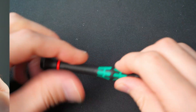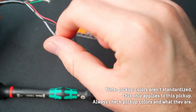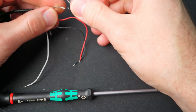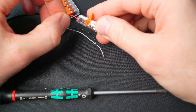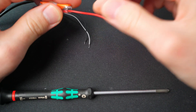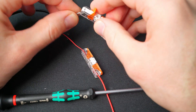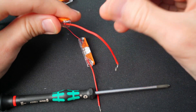You can take it a step further if you switch pickups often. Instead of soldering and re-soldering every time to the pickup selector, you can use these Wago single connector ones. Pretend this is the pickup selector. Here's the common ground lever nut, and here's a pickup with its wires: hot, coil splitting, black and white, and the ground and bare. Put the ground and bare into the common ground lever nut. Then take a single connector for the hot — put a wire on the other side, close it down, and wire that to where the hot goes on the pickup selector. For the two coil-split wires, take another single connector, put it into one side, close it down, get another wire, open it up, and wire that to the pickup selector.